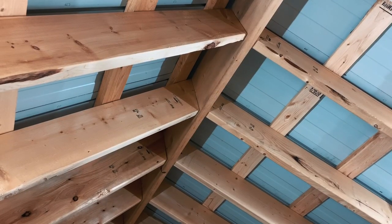I'll be stick framing the gable roof using 2x8 lumber with an 8/12 pitch. Now I've opted to go with a 2x10 for my main ridge board. Since this roof will be exposed from the underside, the ridge board will extend below the rafters, providing a cleaner look.